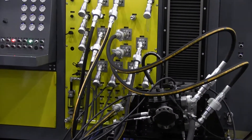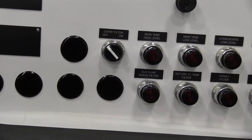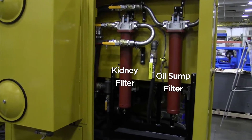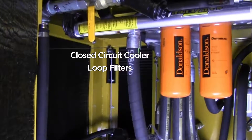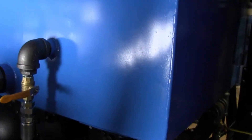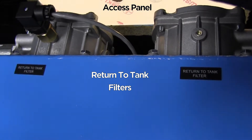The last item to cover in this tech tip is where the various 900C test center filters are located. The total number of filters will change depending on the options ordered. On the lower left of the control panel, you will find filter indicator lights. When a light turns on, it indicates that the corresponding filter or filters require service. The kidney filter and sump pump filter are both located behind the right side door. If ordered, there are two closed circuit cooler loop filters behind the left side door mounted near the test center service light. Both filters should be serviced when the cooler filter indicator light turns on. To the left of this door mounted to the back of the test center is the hydrostatic drive filter, and to the right is the aux pump filter. There are two return to tank filters mounted in the main tank, with an access panel on top of the test center to service these filters. Both should be serviced when the return to tank filter indicator light turns on.